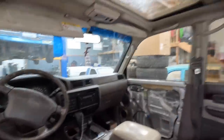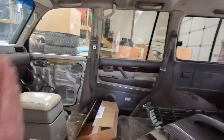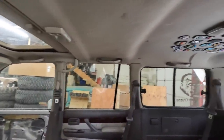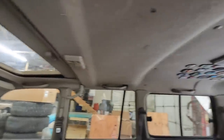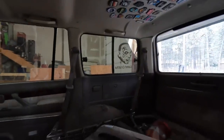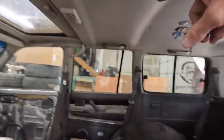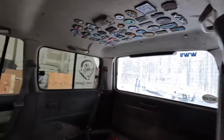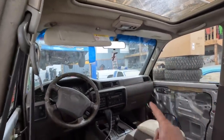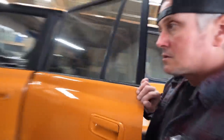When I look in this rig and try to figure out how I'm going to do a roll cage, I'm basically looking for a few different things: where the seats are — which we don't have — where I can tie into the roof, and kind of how much protection we're trying to get out of it. We've got a drop down for this sunroof that's kind of getting in my way. On this rig I basically feel like we need a roll cage structure over the rear seat area, some triangulation down to the back, and then I've got to get some bars up and forward and down and around the dash. Let's start laying this out and see what is going to work best.